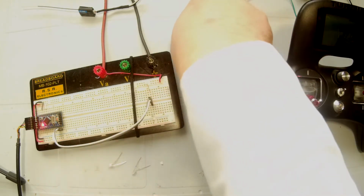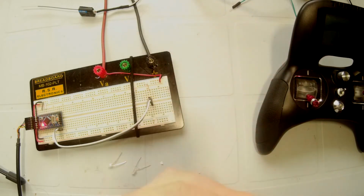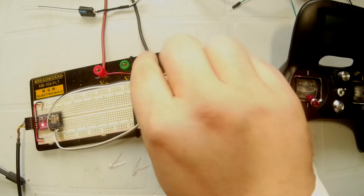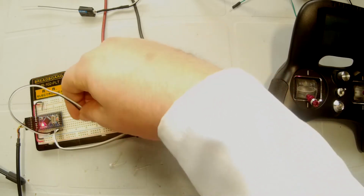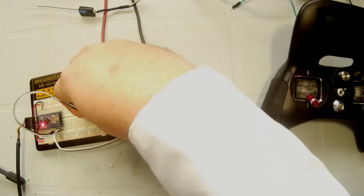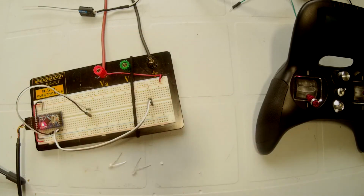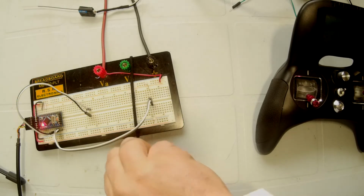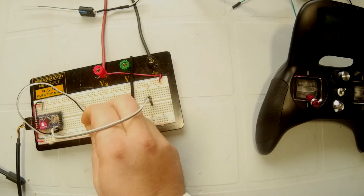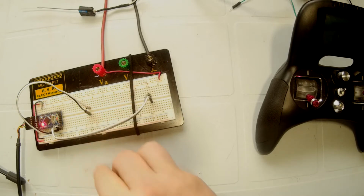The next jumper wires we're going to use are going to go to pins 5 and 6, which were chosen because they have a very specific PWM capability, timing-wise, that will make controlling motors much easier. So once again, we're going to take the LEDs, and we're going to go from that signal pin to ground, and this signal pin to ground.